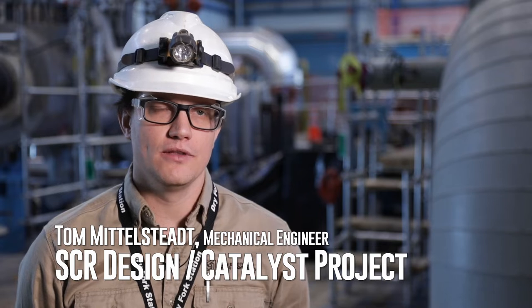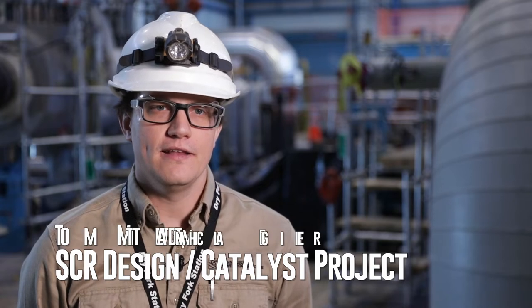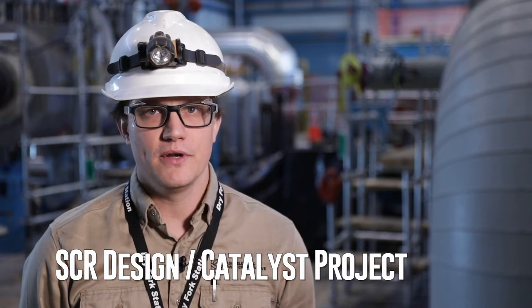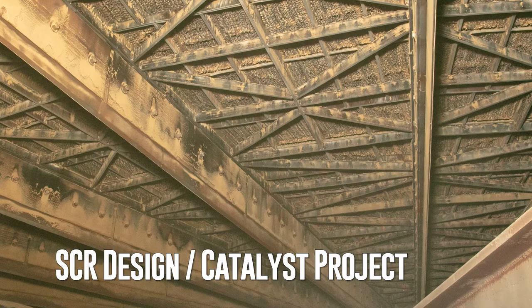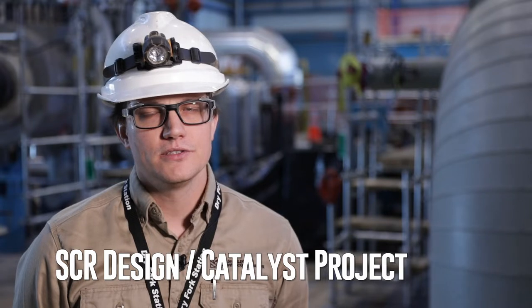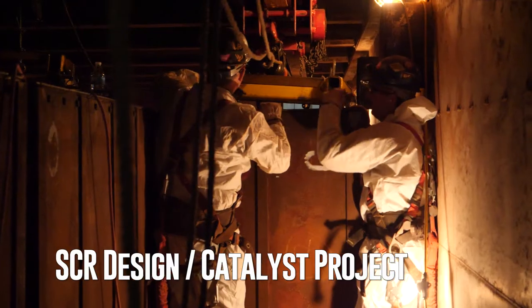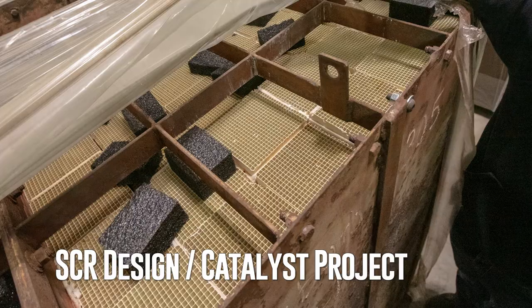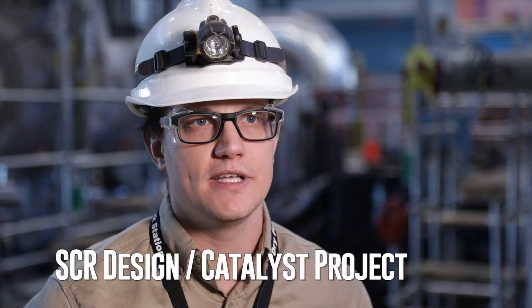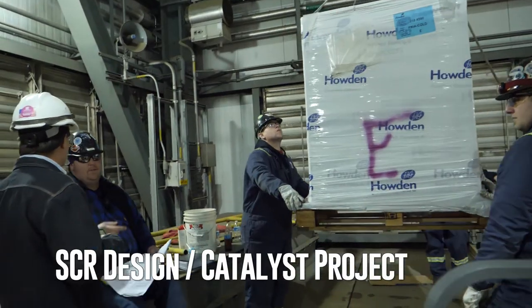On the back end, the SCR is there to help control NOx — nitrogen oxides. Basically, they inject ammonia right before the catalyst, and the catalyst helps promote the reaction between the NOx and the ammonia. Every three years during a major outage, they have to add, remove, or change out catalyst because it depletes and new catalyst has to be put in. This outage we're removing two layers of catalyst and adding another two. To change out the catalyst is a pretty big job — there are 140 catalyst modules per layer, so with two layers you're looking at 280 modules that have to come out, lowered all the way to the ground floor, and then 280 go back up.